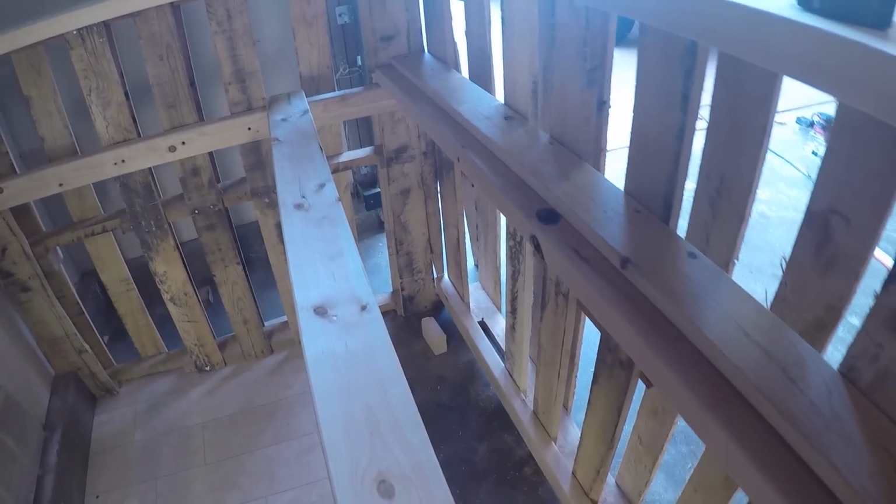So as you can tell with that support beam that I zipped in earlier, I'm using that same support beam and I'm using the other 2x3s to build a shelf back here. That way you can hold stuff back there, glasses, shot glasses, bottles, anything that you really need back there. I framed in those shelves after I laid them down, just like I did the top.